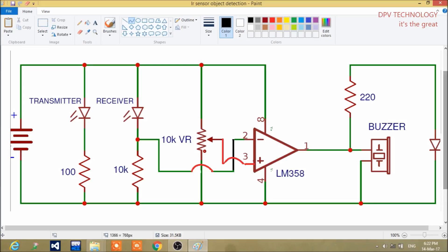Now again, if we apply a voltage at pin number three of the IC — the non-inverting terminal — which is greater than the voltage applied to pin number two, the inverting terminal: let's say pin two is grounded and pin three is connected to plus two volts, then the op-amp will give a voltage very close to plus nine volts. So if we apply a voltage to the non-inverting terminal that is greater than the voltage at the inverting terminal, it gives a positive output. The inverting terminal, if given a higher voltage, inverts the output to negative.